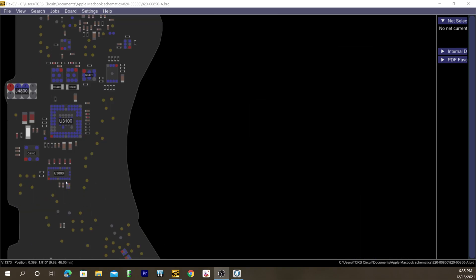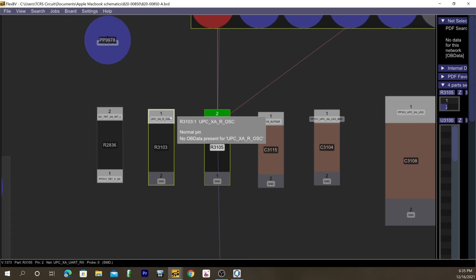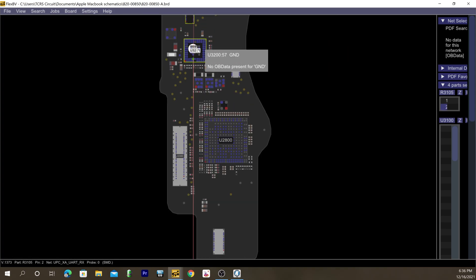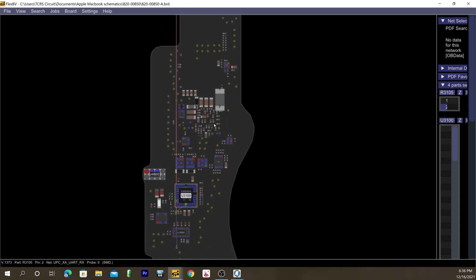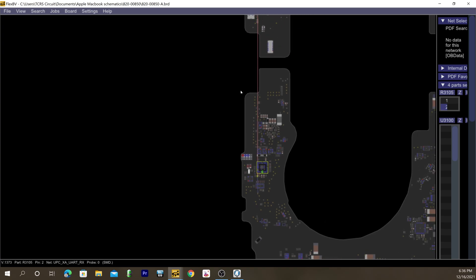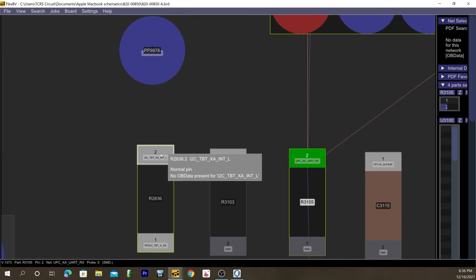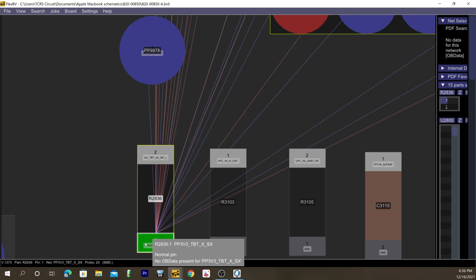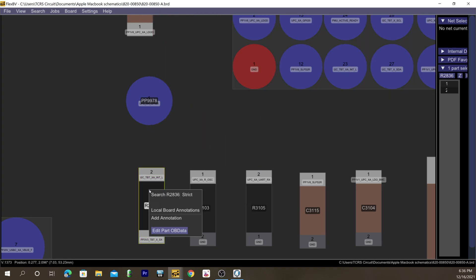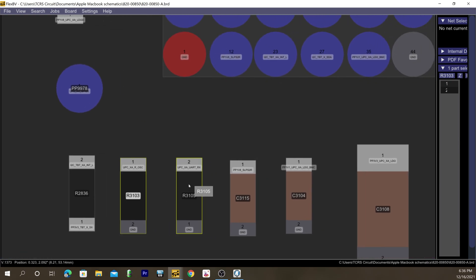Board view is open. These components appear to be on a CD3215 communication line — cross communication between two CD3215s. If these can't talk to each other, the system will not work. This is actually a poor design: every CD3215 has to talk to each other and to the T2 for the system to even turn on regardless of whether anything is plugged in. The adjacent resistor is a no-stuff. Confirmed values: one resistor is 15k and the adjacent one is 1 megaohm.